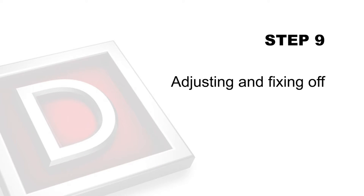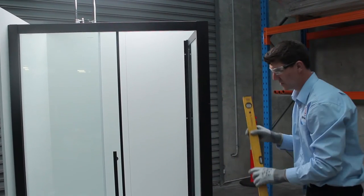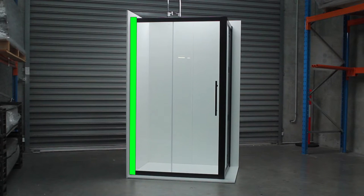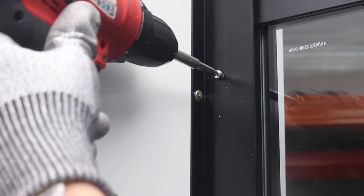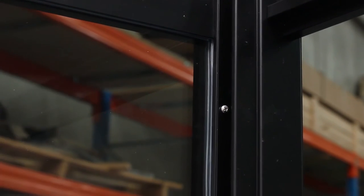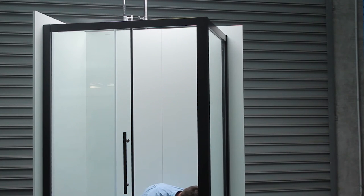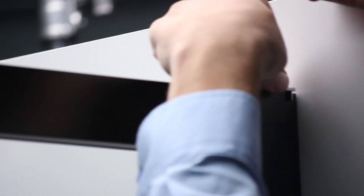Step 9: Adjusting and fixing off. Ensure screen is level and square. Adjust and move panels in or out to suit your shower base or shower area, ensuring all sides are level and straight. Fix front fixed panel and side panel to wall profiles by drilling four equally spaced 3.3mm holes on the inside of screen and secure with screws provided. Fix corner profile to the front fixed panel by drilling four equally spaced 3.3mm holes on the inside of screen and secure with screws provided. Using thumb pressure, attach the screw cover caps to the heads of screws internal of screen. Attach the cover caps of wall profile to the top of both wall profiles, and attach the cover cap of the corner profile to the top of corner profile.